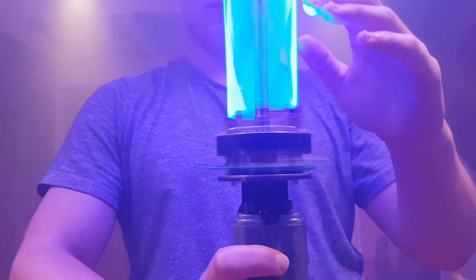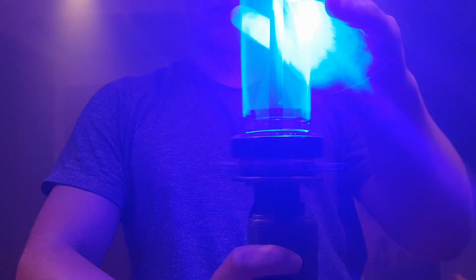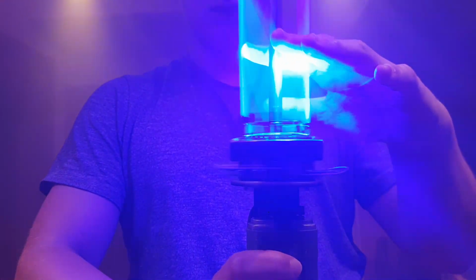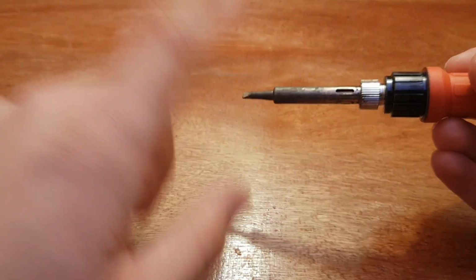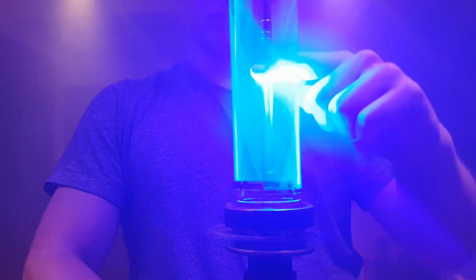You may be wondering what can burn. Well, since the lasers are rotating quickly, they don't shine on a specific point for very long and can't heat it up. Like how if you touch a hot object for a short period of time, you won't get burnt. However, it will cause eye damage since the retina is very sensitive. Once the lasers are stationary, when properly focused, they can burn things quite nicely.